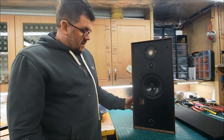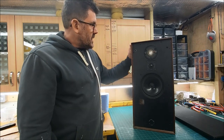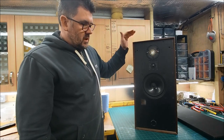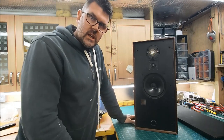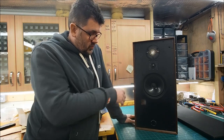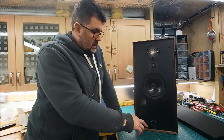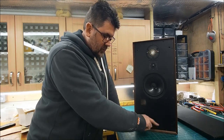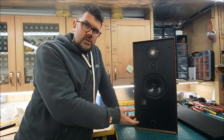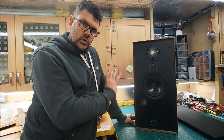It's not something I'd do for a client, but for me to waste my time on them and repair them and wrap them is okay. So that's what I'm going to do. I'm going to repair both cabinets, fill them, sand them, build a new piece of moulding for the bottom of the other one, and then wrap them like I've done with my studio ones. That way we're going to have two good cabinets.